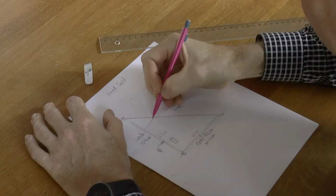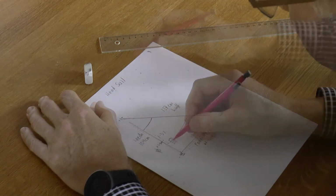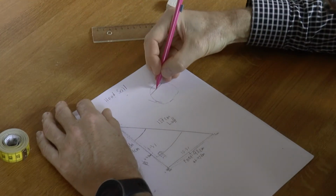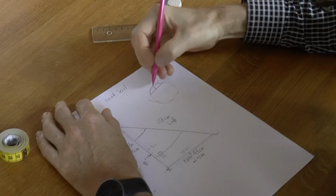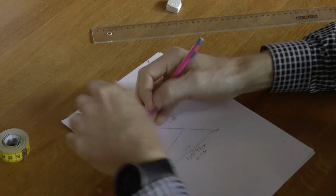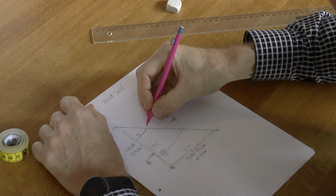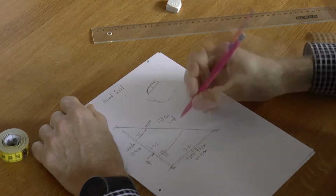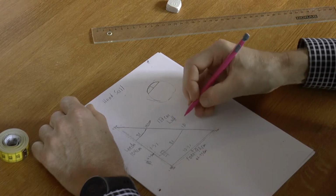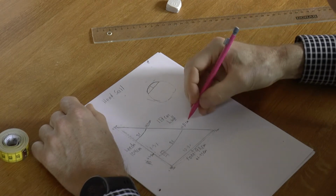At 1/3 of the sail up and 1/3 of the sail from the bottom, I will use a mathematical formula for a chord to calculate the necessary addition to the sail. This extra cloth will be pulled into the luff, creating the camber. I have this distance, that's the distance from the back end of the sail to the front end of the sail. And for an 8% camber, I need to extend this length of the cloth about 0.5 centimeters. And as this distance is longer, 8% camber depth will be created by extending this 1 centimeter. And then I also need to have a seam allowance in the front of the sail.